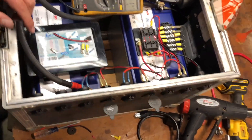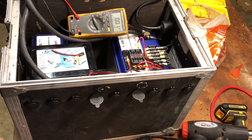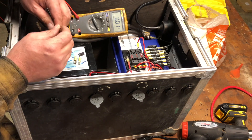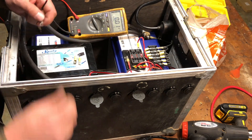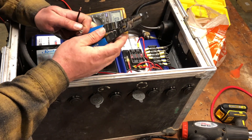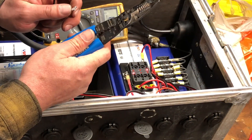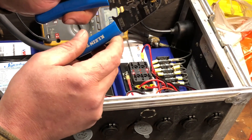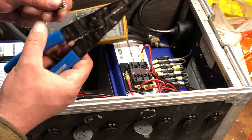Let's talk about wiring for a bit. I just want to share a few things I've learned — this isn't necessarily the only right way, but this is how I've been doing this stuff for 30 years to make a living. If you're going to use a crimper, you want a good one. This particular style is my favorite. The ones with just a clamshell on the front that come in a terminal kit — those are no good. You need to have that little raised point on the crimper in order to impinge on the terminal and make a good crimp.